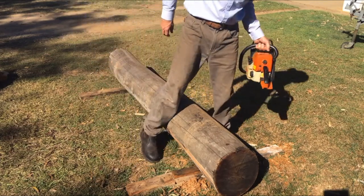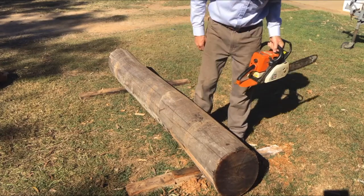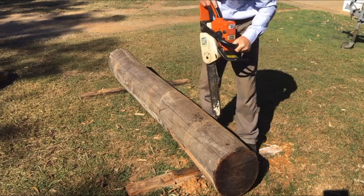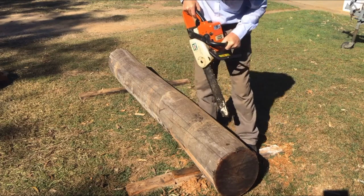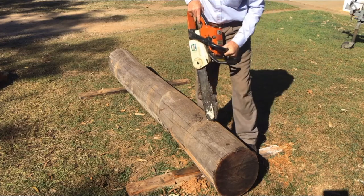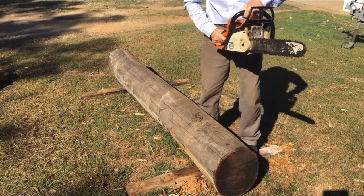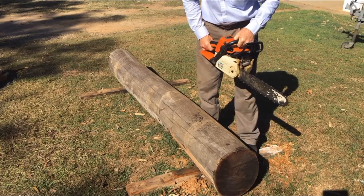When it starts to sound like a good idea, you saw me the other day, I cut a mortise out of another post, a square hole, going straight down. You think, oh yeah, why don't you use your chainsaw, Dave? Come along, straight down. Cut it out this way, cut it out that way. But all of a sudden, you're using the dangerous part of the saw. And what can happen is, as you're cutting down in, the saw flicks around, pulls it out of your hand, up it comes like this. And it's completely out of control when that happens.